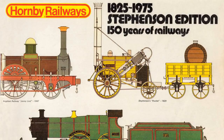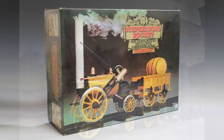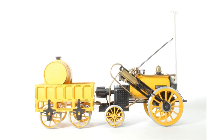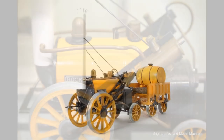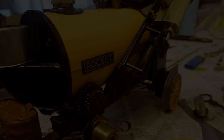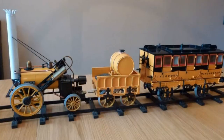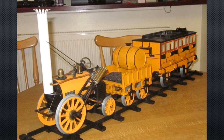As part of the 1980 Rocket 150 celebrations marking the 150th anniversary of Stephenson's Rocket, Hornby released a live steam-powered 3.5-inch gauge locomotive. A major goal was to make real live steam accessible in an indoor domestic environment. The boiler was considerably smaller than the external diameter, surrounded by a thick insulating jacket to prevent burns. It was fuelled by butane gas from cigarette lighter refills. To provide more torque from the small cylinders, gearing was adeptly hidden between the cranks and the wheels. The track was of asymmetric moulded plastic units representing the fish-belly rails of the period, which could be assembled either way round to give either curved or straight track.